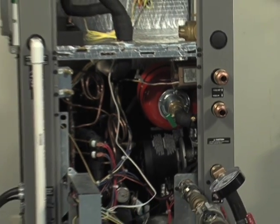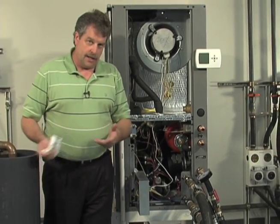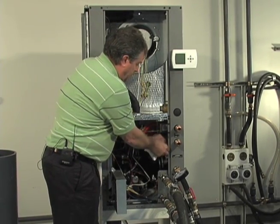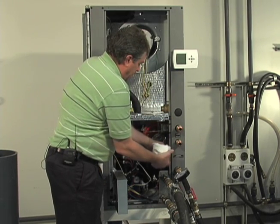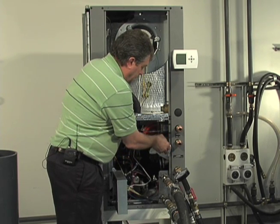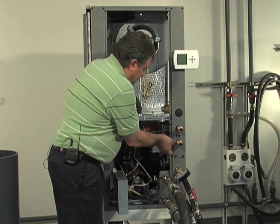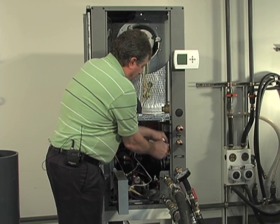It makes you more confident you in fact have removed that air out. So now the very next important step is to bleed the air out of that expansion tank line. Again, we got the pump running. We're under, in this case, about 35 pounds of pressure. We're going to take a rag, depress the valve stem and get all the air out of the small pipe going out to the expansion tank. Do that until we get nothing but water out of the system. There we go. Make sure we put that cap back on.